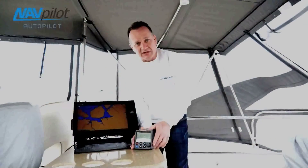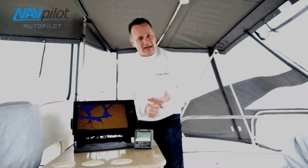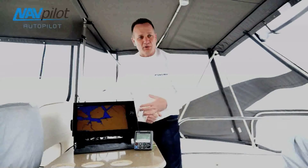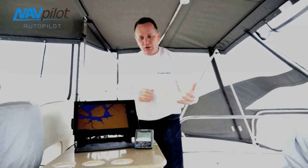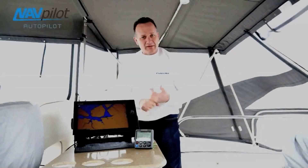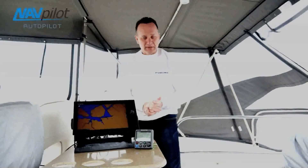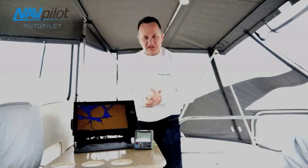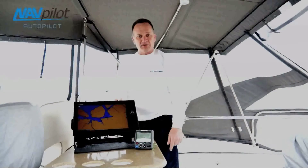The rest of the installation with the NavPilot 700 — with respect to interfacing either an NMEA 0183 heading sensor or an NMEA 0183 component, or sending information out to an NMEA 0183 component, or the NMEA 2000 installation — is all the same. There's no rudder setup anymore. There's no rudder angle information that you have to configure. All that's done by the Volvo Penta system. So this really makes the installation quite simple. From there, we're actually going to go and do a quick sea trial just to show you how well this boat steers with the new NavPilot 700 system installed.